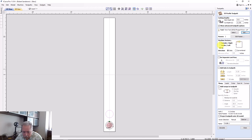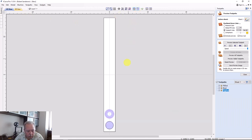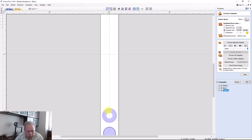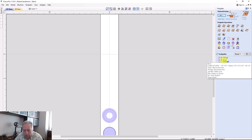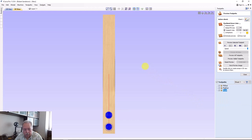I need to change the cut position because of that quarter inch plunge diameter. The router plunge section needs to be right on the inside edge of the profile — if it's not, the roundover won't be in the right spot. So I'm going to do an inside cut with an offset of minus 0.25 inches — the diameter of the bit. No separate last pass, no tabs, no ramps. I'll call this 'plunge round' and calculate it. In the 2D wire frame view you can see it's going to cover the edge correctly.